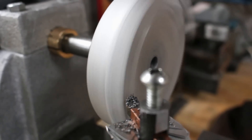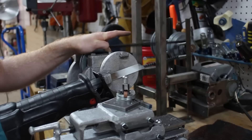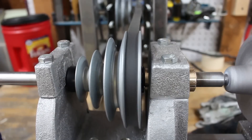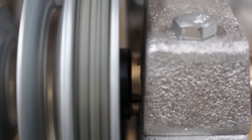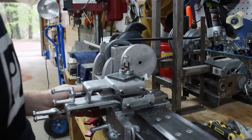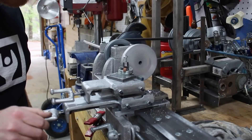Initially I was going to turn off the edges, but I decided the sawzall was a little faster. Even after getting rid of the tabs, I noticed a lot of chattering. It was because of a gap between the shaft collars and the inside of the headstock. So I adjusted the shaft collar spacing and tightened everything up. That made it a lot more rigid for turning.